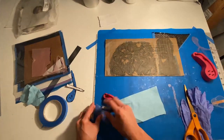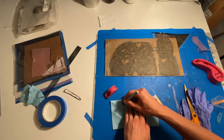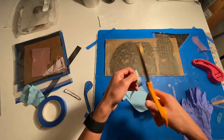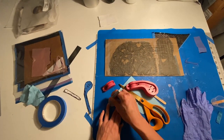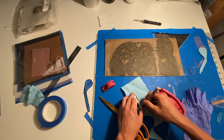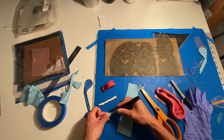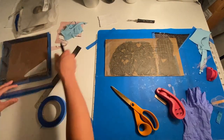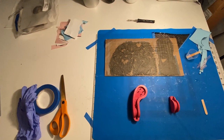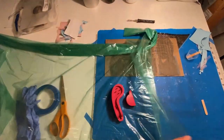The breather helps absorb excess epoxy that comes from the part through the perforated release film. I'm just using paper towels here for the breather. Finally, the green material is Stretchalon 200, which is the main material I used to make the bag.